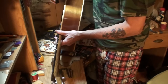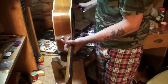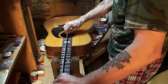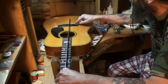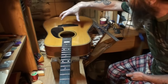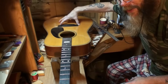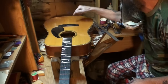It all looks good. This area here that was all sunk down — I think that was due to a brace that broke inside there. It was just failing. It looks flat across there now. Looking mighty fine. Here is something very important we want to see: 50 thousandths clearance. That's quite a bit, but like I said before, we don't know how much deflection we're going to get right here. As I mentioned in the other video, when you go tightening those strings up and put that guitar under string tension, all acoustic guitars belly up to some extent. We've never seen this guitar with strings on it — it feels solid, but we still need to make a saddle for it.